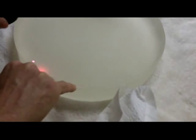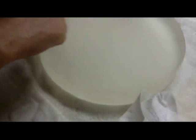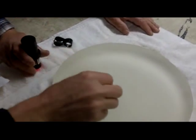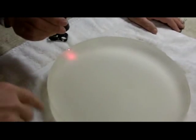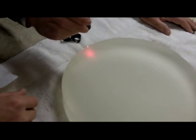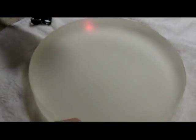Can you see the black mark? That's a Sharpie. And so what I did was I took a Sharpie and smeared it all over the mirror. I got to thinking that the Sharpie leaves a layer, right? So I took my gloves. I was using nitrile gloves. I put a dot and smear it, and dot and smear it. I put all these little streaks all over it, and then I ground it. I ground it until I ran out of energy that evening. You get the marks out? Yeah. I got all the marks out except for these out around the edge.